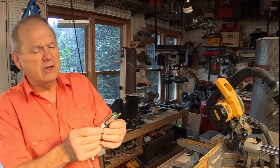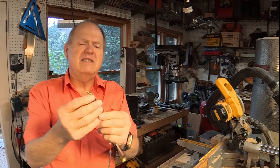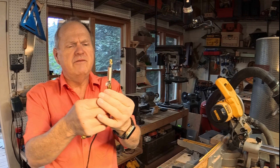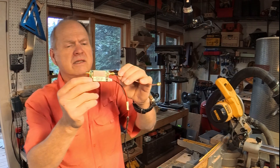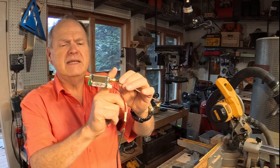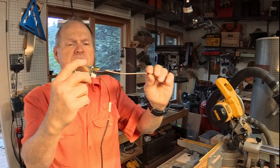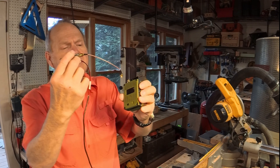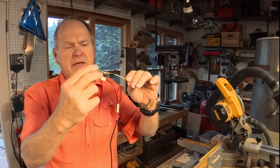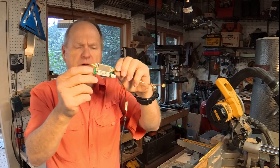Now let's talk about the little device. I have several of these — I've 3D printed some cases to help protect it, but here's just the device by itself. If you look at it, what you've got is an input side and an output side. On the input side, that's where you're going to have your cable that goes to your Meshtastic radio — you'd remove the antenna, screw the SMA connector onto the radio, and then that's going to go to the input side of the amplifier.